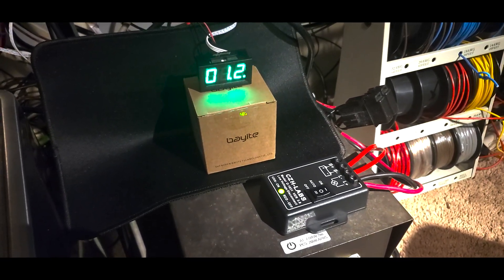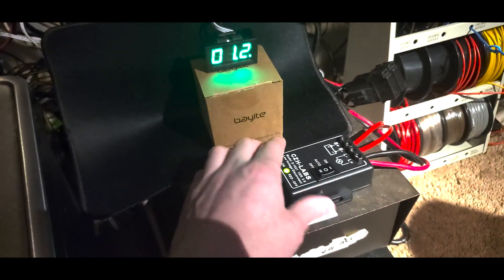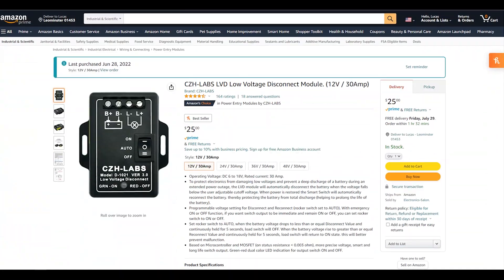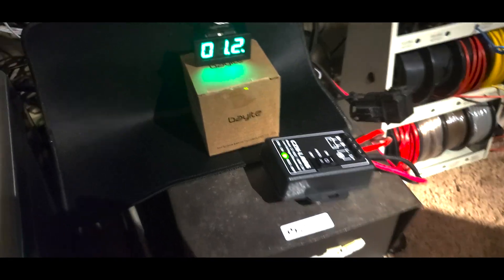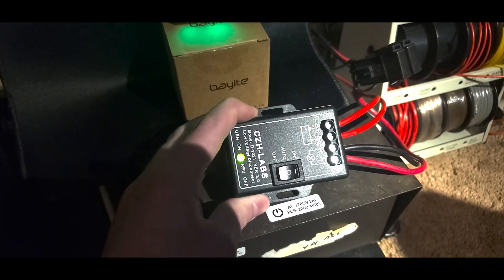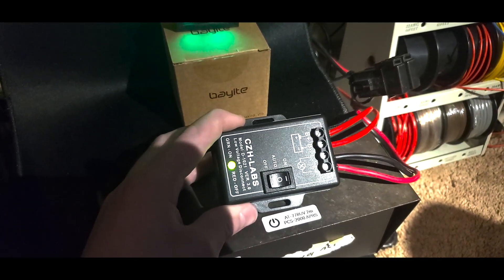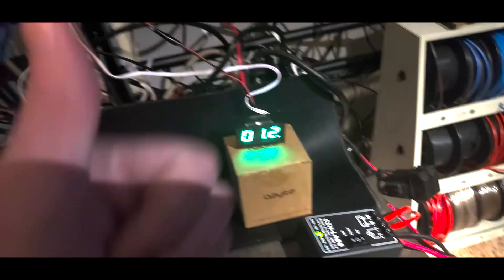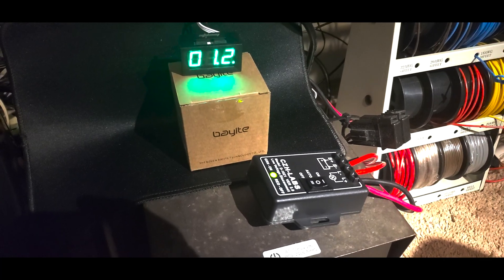This seems like a great option for any ham radio setup. If you're hardwiring into your battery, or if you've got a portable setup that you really don't want to discharge more than 60%, this could really extend the life of your battery. It's the CZH Labs LVD low-voltage disconnect module — they have it for 12 volts and 24 volts, and I think even 36 and 48 volts, but for ham radio we're only going to be doing 12. It's 25 bucks on Amazon right now for this little unit and that seems like a pretty fair price. The fact that you can set it with the dip switches on the side really adds to its value. So yeah, that's it for today — thank you guys so much for watching, I hope you enjoyed, and I will catch you in the next video. If you did enjoy, be sure to leave us a like and maybe give us a subscribe. Let us know in the comments if there's anything you liked, anything you hated, any feedback, and I'll take a look at it. Thanks so much and have a great day.